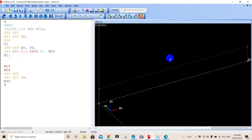We're going to 1 inch long, and now we're going to go into the job. We're going to go Z G01 because we're in rapid at the moment. We want to go G01. Feed rate, our feed rate's 1 inch a minute. We're going down with it, so it's standard anyway. We don't need to do that again. We could type in another feed rate, but once this feed rate is in here, that will always go to that feed rate if we call G01, unless we call another feed rate. It will stay in that because it's modal.